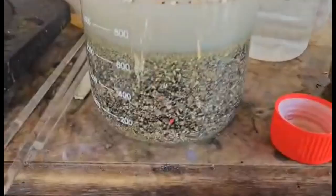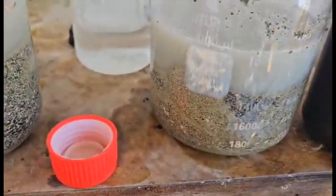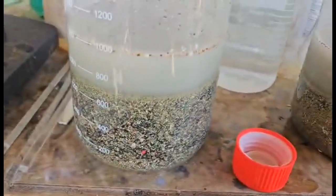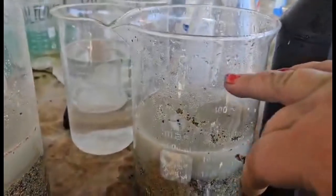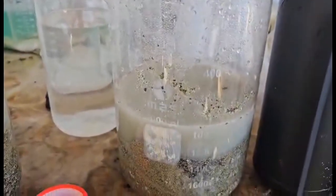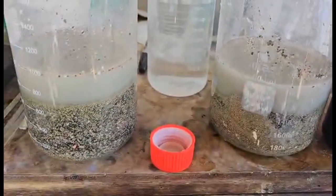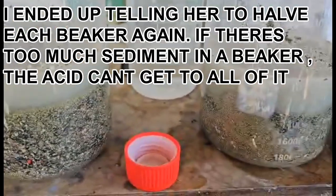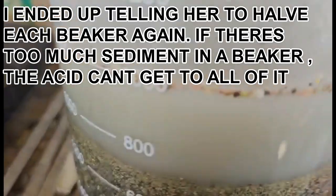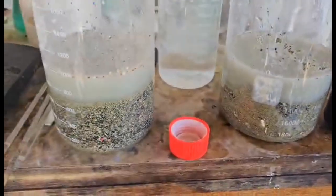That's the sediment that's left. I've now put it in halves because it would have been way too much sediment in there. I've put tap water in to cover it — there's a bit too much in there but there are still gold flakes floating — so I'll leave it where it is and put some nitric in.